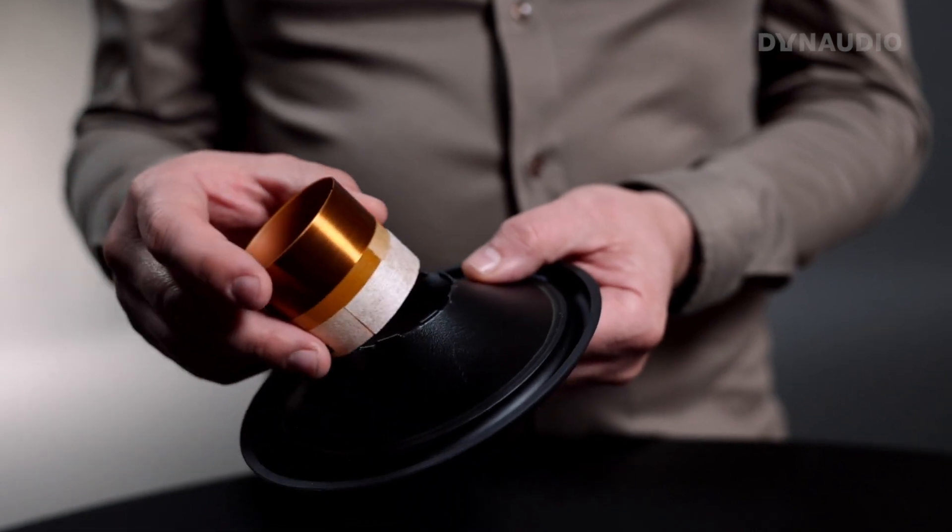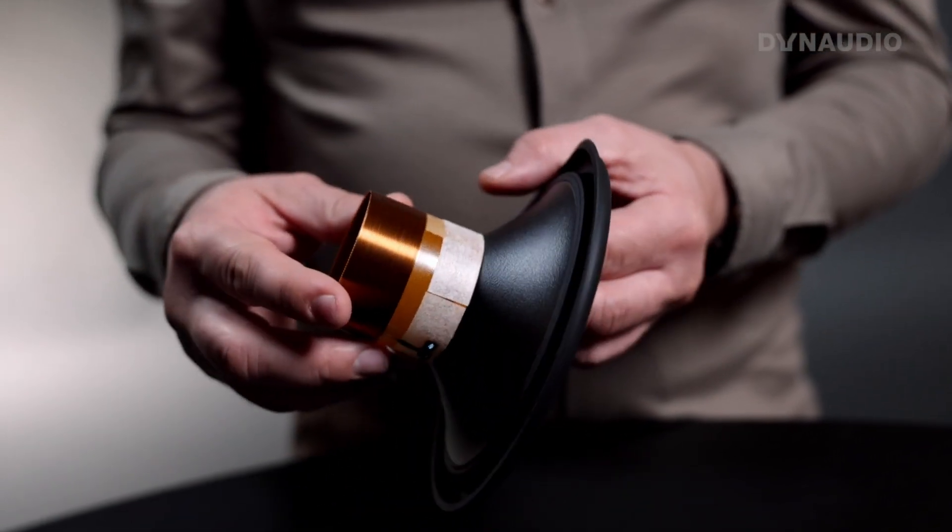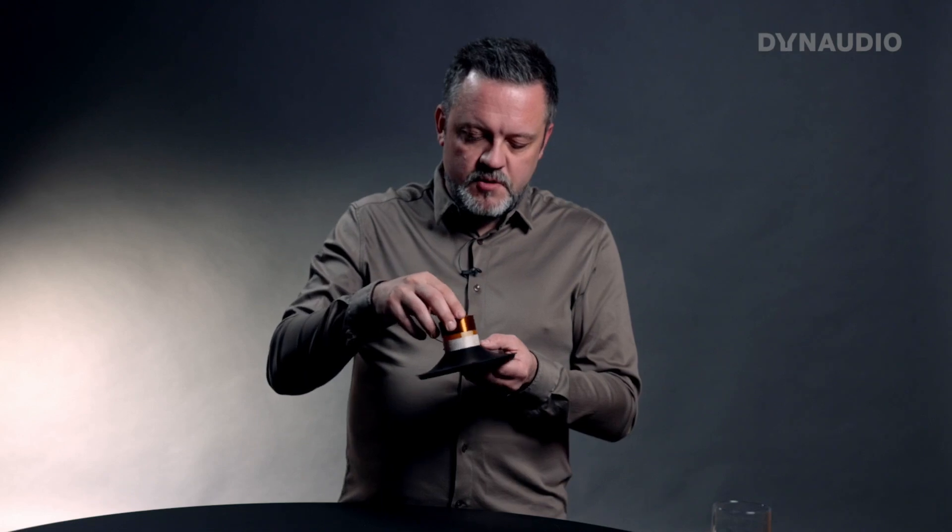So the question becomes: why did we have those dents in the first place? There are actually three different reasons. The first reason is that, due to the dents, when you put on the voice coil, the voice coil is automatically centered onto the diaphragm. This gives a perfect centering of the coil, which would not be the case with just a round dome — here you only have one perfect position, which is dead center.